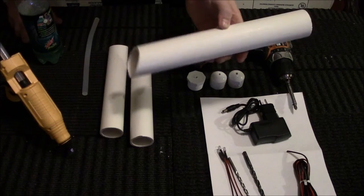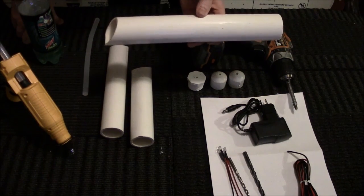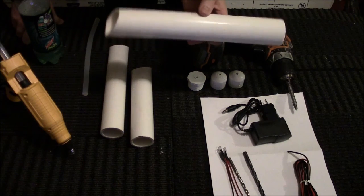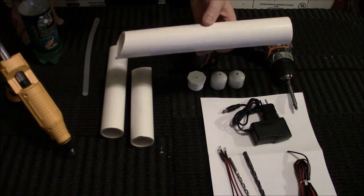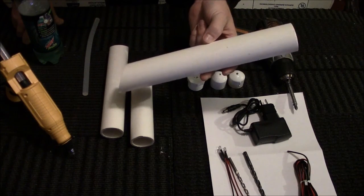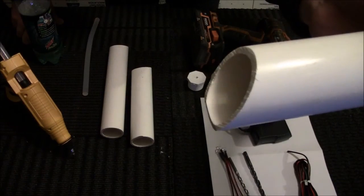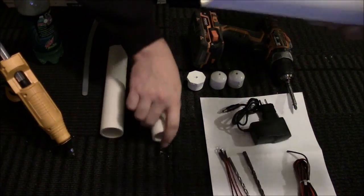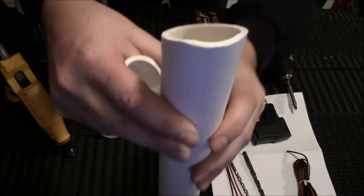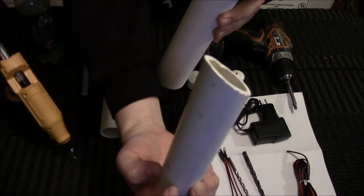You can use a chop saw with really any blade as long as it goes fast. The more teeth, the finer the cut you're going to get, but I think mine has a 60 tooth blade on it, and it did this. So, pretty clean cut. And then the angle on it too. This is a 45-degree angle. You can cut it, as you can tell, like on this one, it does have a bit of a flat edge on it, where this one does not.